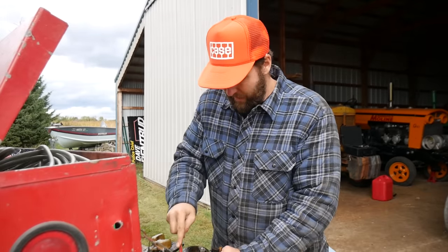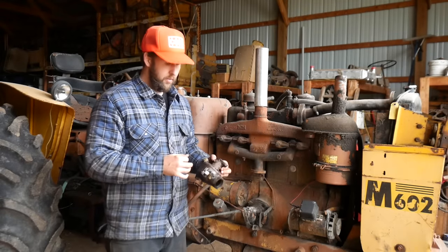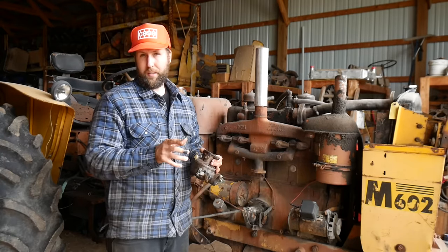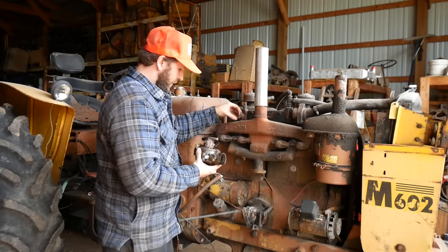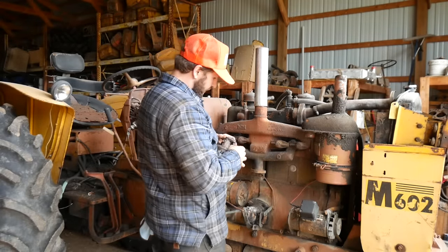This is coming right off. New needle, seat, float, adjusted them, 1/4 inch it says. And pay attention to your kit. Some say adjust with or without the gaskets. Cleaned everything out, brushed everything. So I think we'll throw this back on and see what she tells us.